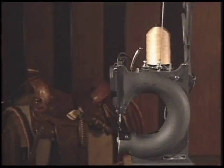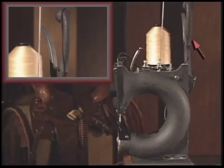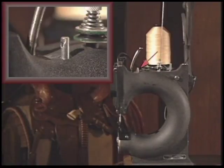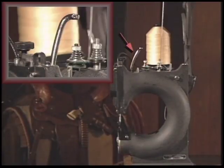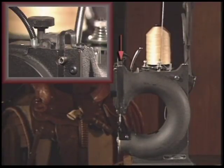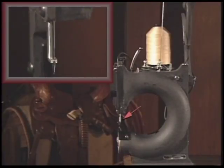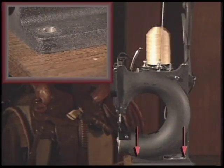Open your manual to page 5. Looking at the Boss, starting at the top: the stitching handle with presser foot lifting handle, thread guide B, thread guide C, the secondary tensioner and primary tensioner, thread guide F, the presser foot cable, the needle thread take-up arm, the presser foot tension adjuster dial, the needle bar, thread guide H, thread guide I, the presser foot, the stitch length adjuster dial, the needle foot, the needle plate, the bobbin shuttle with bobbin inside, and finally the mounting holes.